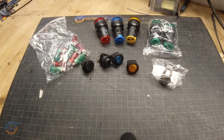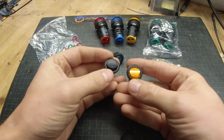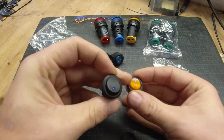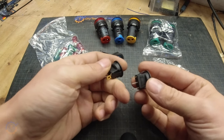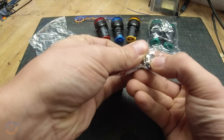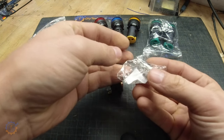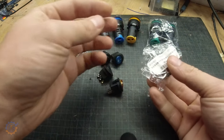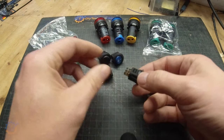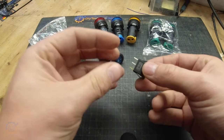Last but not least — you can never have enough lights, indicators, and buttons. You need them to turn things on or off or just indicate that something is ongoing. I've bought several different types of buttons: typical on/off buttons with LED indication inside, either a small LED or one that lights up the whole button face. Those are 12 volt and easy to use with your Arduino. I also bought push-buttons that latch in when pressed and release when pressed again, also LED-indicated. I always choose round ones because you can easily drill the hole with a step drill — rectangular ones are much more work.